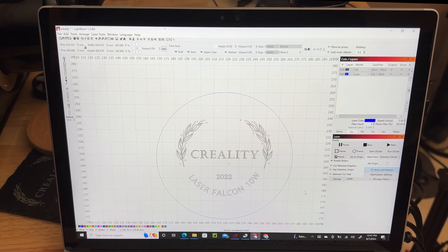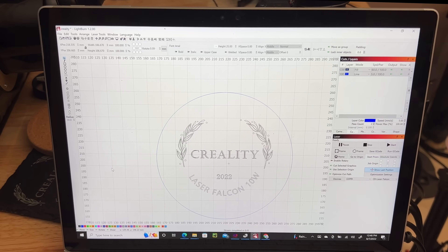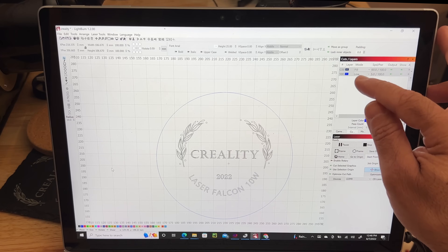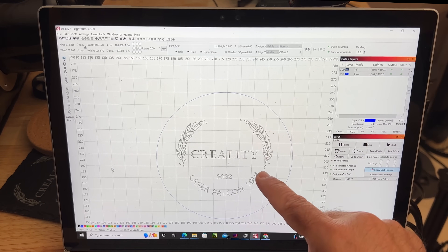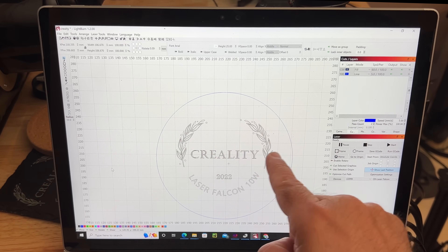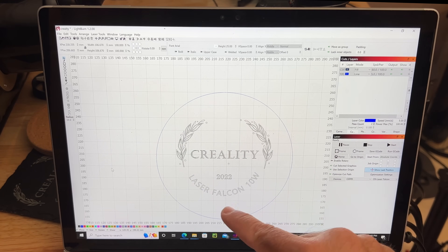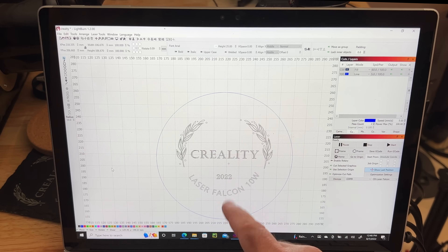Lightburn is a pretty powerful application with a lot of flexibility. The graphic I created is focused on two parts: the first part is the engraving, and the part in blue is what's going to be cut. Up in the upper right-hand corner, one layer says 'fill' — which is going to be filled — and the other says 'line,' which is the cut line. The power is 100 on both, but the speed is a little different. Because the black one is on top, it's going to first engrave, then after it's engraved it will cut. I typically don't cut first because the actual item could shift. This has been centered using the vertical and horizontal centering tools.